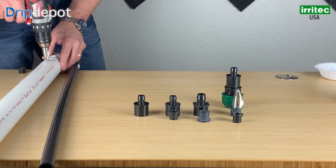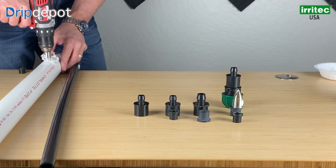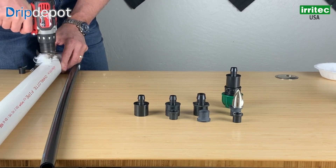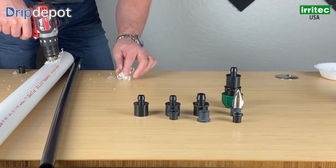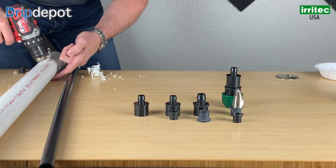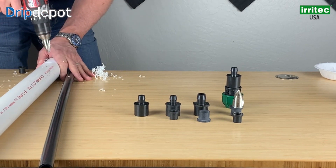It sits right there — it's just self-tapping in. The drill bit is set, and as you can hear, it has a shoulder so it will bottom itself out and not allow itself to go any deeper, possibly going through and compromising the pipe underneath, and then just back it right up. You don't have to put it in reverse.